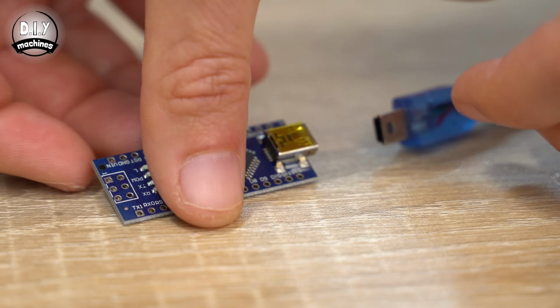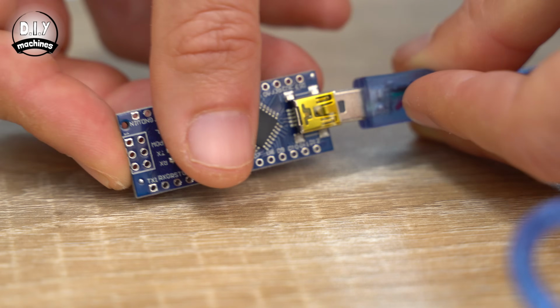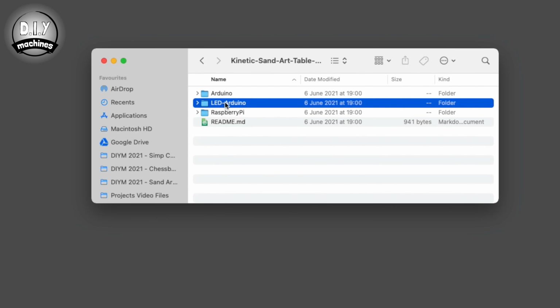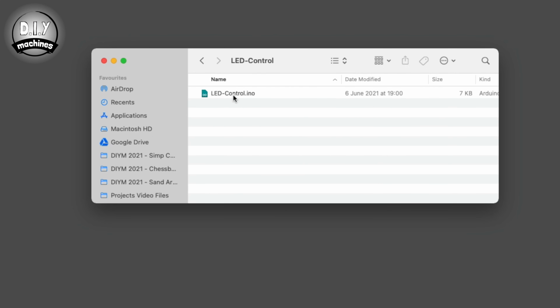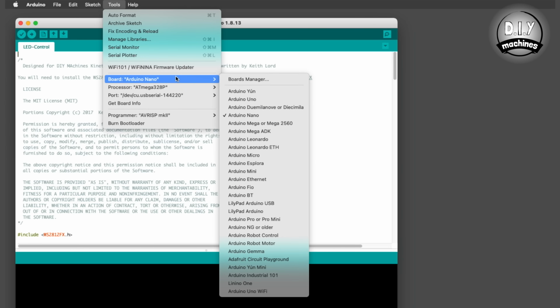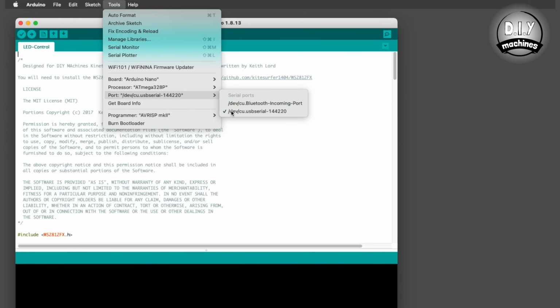Next up, we will install the Arduino Nano so that we can put the LED lights and their control panel buttons through a test. We will upload the code to the Arduino Nano by first connecting it to your computer with a USB cable. Open the Arduino IDE and the code for our project. The code for the Nano is found inside the LED Arduino folder. Don't forget, links to download the code and everything else for this project are available in the description down below. Select the correct board type of Arduino Nano and the port for your device before pressing the upload button.